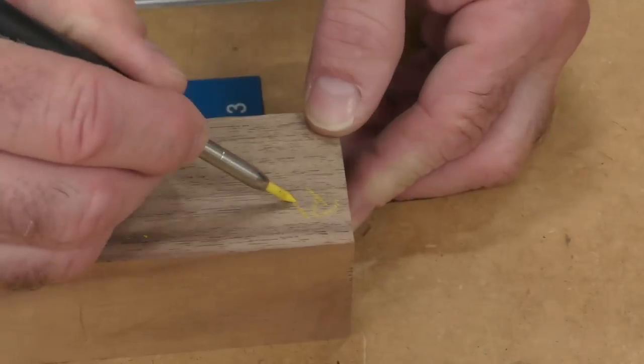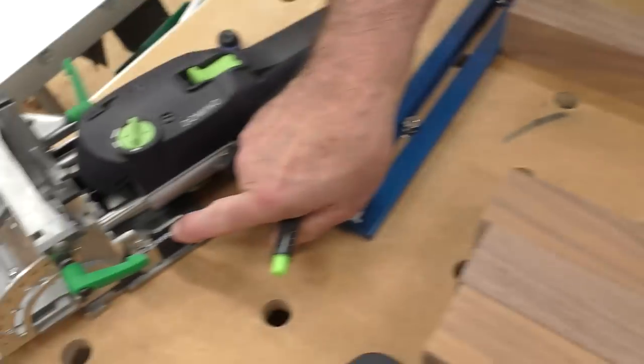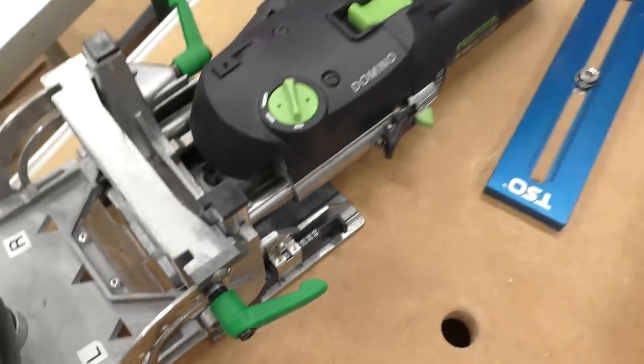Our plate height is going to be 40 in the window. When we put 40 in the window, I'll explain it and we'll go through the math. It's a quick way to do an offset on the machine.